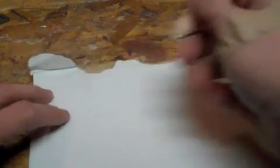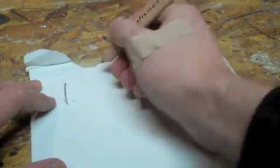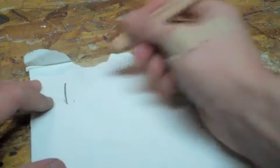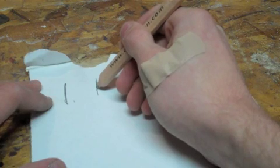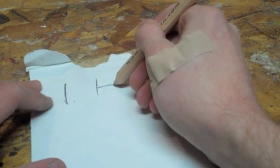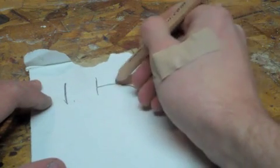The first one is when you end up with a stiff spot. So what'll happen there is that you'll get the one limb of the bow coming out and curving, then not curving, and then curving more. So right there is a stiff spot. And that's pretty easy to do. All you do is just take down the wood that's in between those lines.